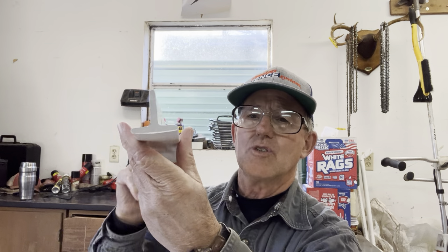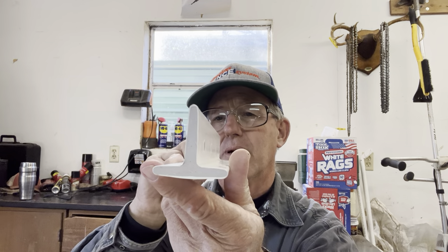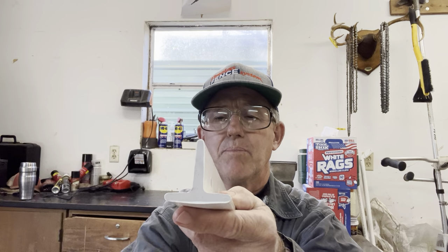There are different sizes. This is an inch and a half, which I like — this is a four-footer. Then there's a wider one: if I was going to build a perimeter fence, this is the one I would use. This is an inch and three-quarters — it's a really stout post. They also make them in a brownish color. What I like about the Timeless is you don't have to paint them and you don't have to worry about UV. See that white layer around the edge of this post from the end view? That is your UV protection, already built into the post.